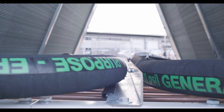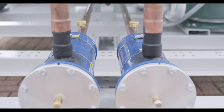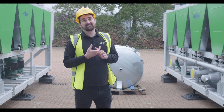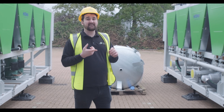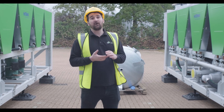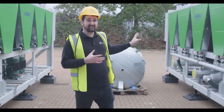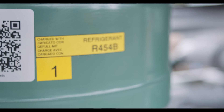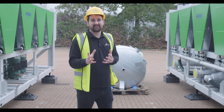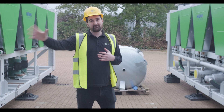Water then enters into these chillers. As it enters the chiller, it's really got two options. The first option: 90% of the year, ambient temperature in this country is normally below 19 degrees, which means we can exchange the heat through the water with enough ambient air to bring us down to our supply temperature of 21 degrees. On those rare occasions when we get a slightly hotter, sunnier day, it goes through the shell and tube heat exchanger on the bottom here with the refrigerant cycle running alongside. The refrigerant cycle then takes that excess heat out of the water through that heat exchanger, and the water can go back into the building through the lag pipe and back in.